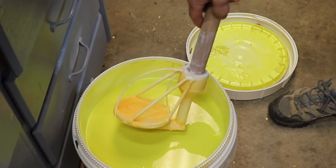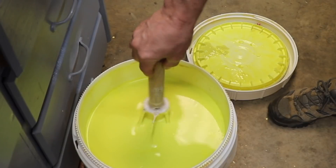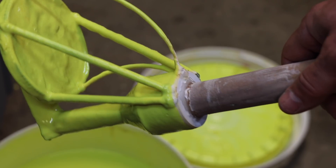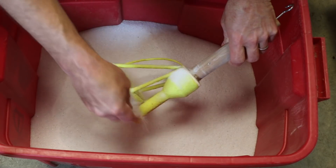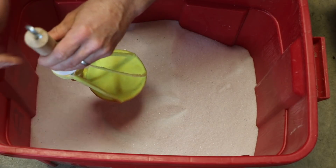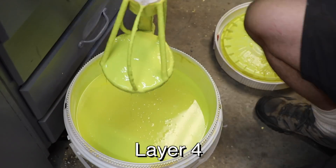Again the orange color after it's dried for several hours. This is dip number three. And now I use a coarser silica sand — this is 30 to 50 mesh, so that's between 0.3 and 0.6 millimeters particle size. And we continue this process building up layers.